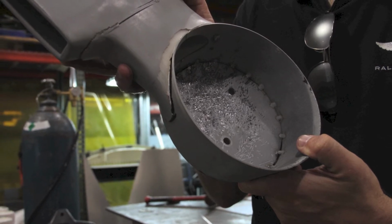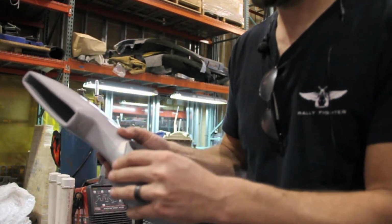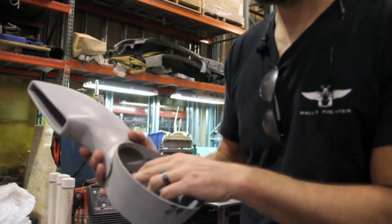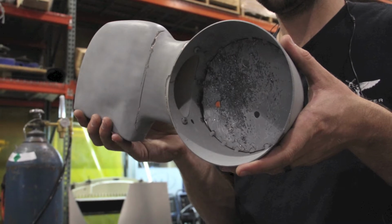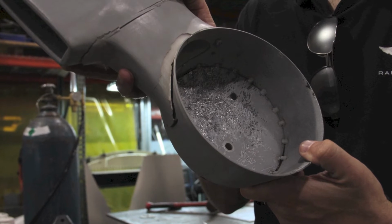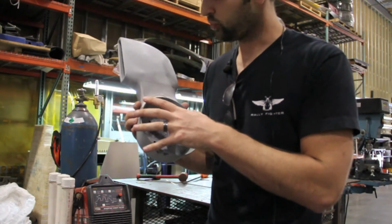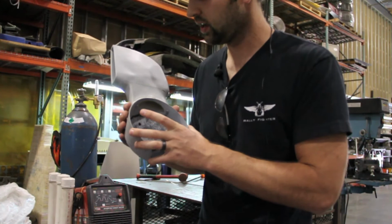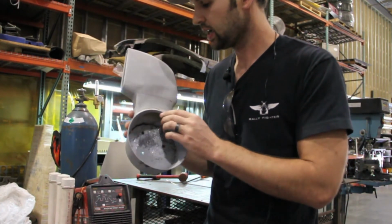In the way that it actually broke down, what we found is that probably the reason that it first fractured before we got more spirited with the air hammer was that as we were deflecting that internal disc and shocking this unit, the cone section here actually started to turn from a circle into some kind of an oblong and pulled itself away from that neck. Normally that wouldn't be that much of a problem. Again, we're more worried about the vibrations.